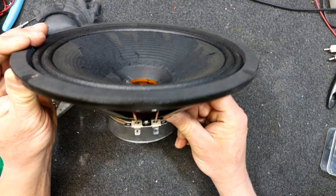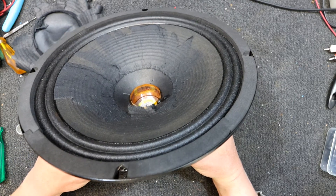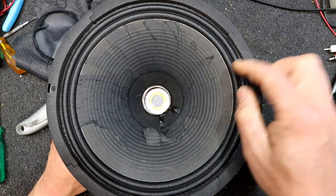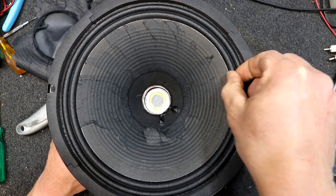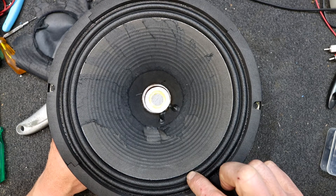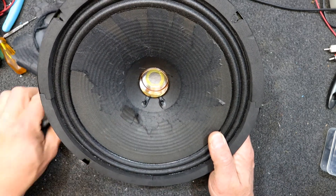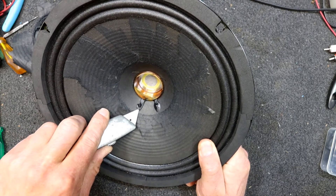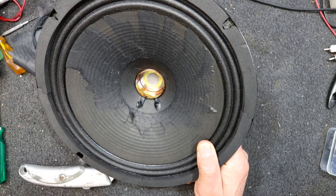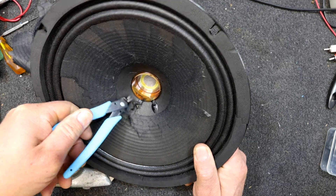It is joined also to this — there's a kind of orangey-yellow material, like a cloth soaked in varnish or something. There's some sort of suspension material in there as well as the actual cone itself. The foam isn't really very foamy — it's quite stiff, like cloth soaked in epoxy, fairly hard. Now those two wires that come through the back come up to these little dobs of glue, possibly little eyelet things, and then join onto the very fine wires that go down to the voice coil.